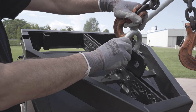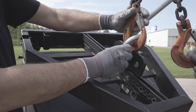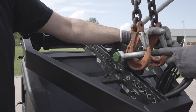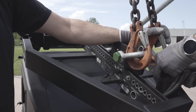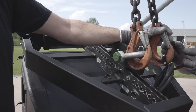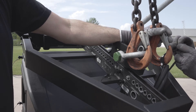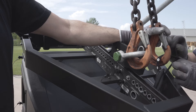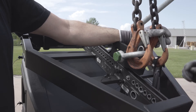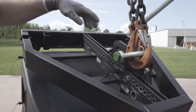At this point, we hook the lifting system to the flybar. We suggest working with a double chain in order to use the second attachment point to fix the wiring, which in this way will rest on the lifting system and not on the flybar. This will prevent heavy cabling from affecting the overall inclination of the cluster once in the air.